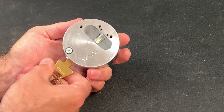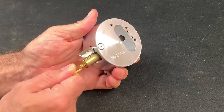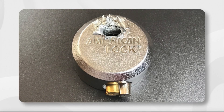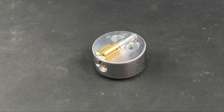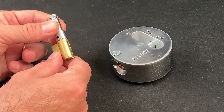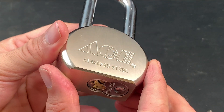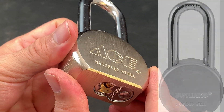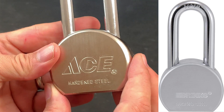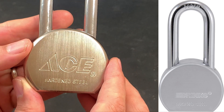The American 2010 is an improvement on the 2000 series in at least two ways. First, it's cast in steel rather than zinc — the old model was easily melted and therefore compromised using a plumber's torch, for example. And in addition, Master Lock did away with a small retaining screw within the mechanism which makes it much more resistant to pull attacks. The company that manufactured the ACE A527 round-bodied lock is actually Brinks, and the difference between this and the original Brinks version is that this has only five pins while the Brinks is a six-pin design.